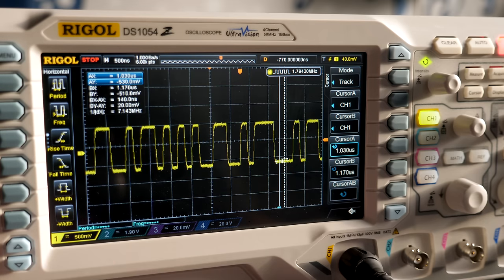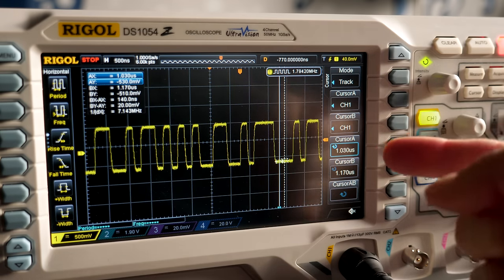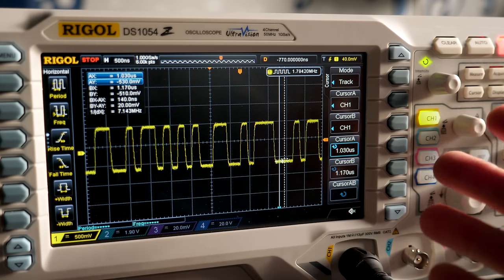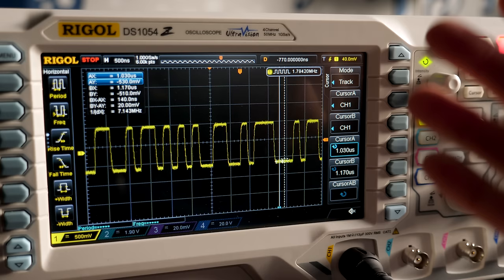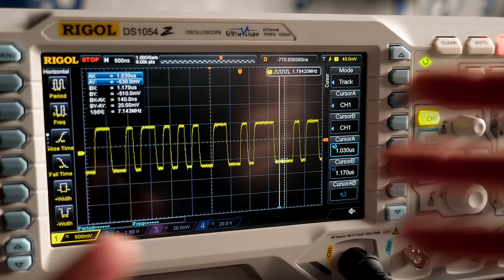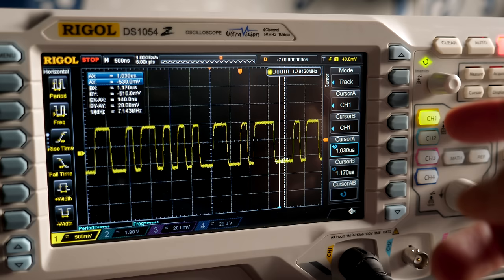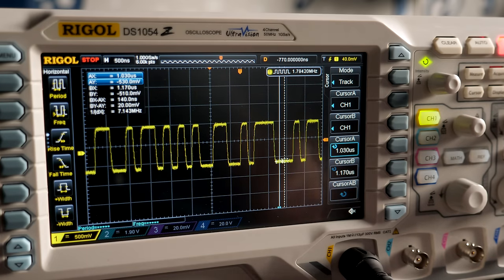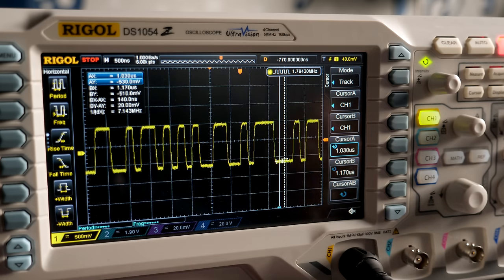The voltages were intentionally made very different between S/PDIF and AES — my guess is to keep people from using one with the other, like a professional AES-based recorder with a consumer playback device. But what's curious, at least with this particular DAT recorder, is that sometimes the tolerances are so loose they work fine anyway.